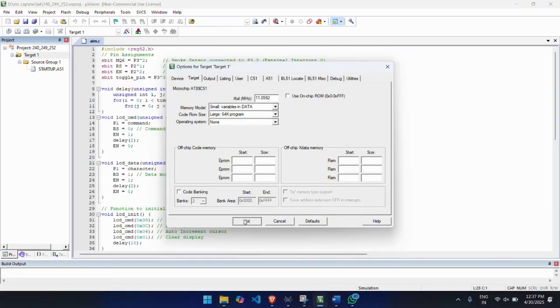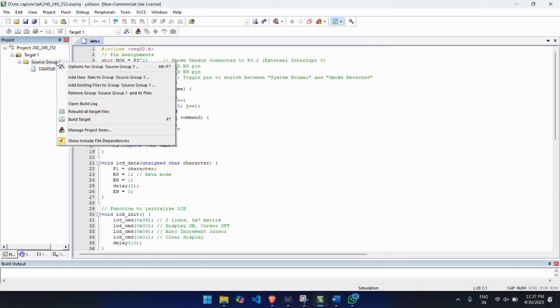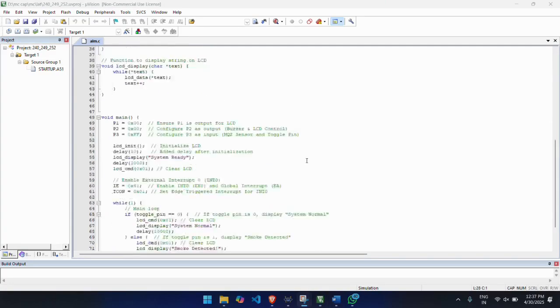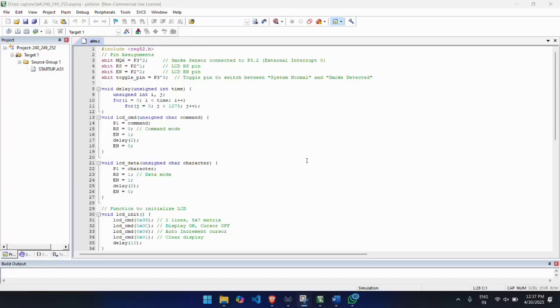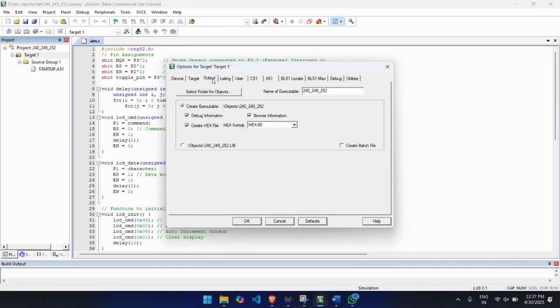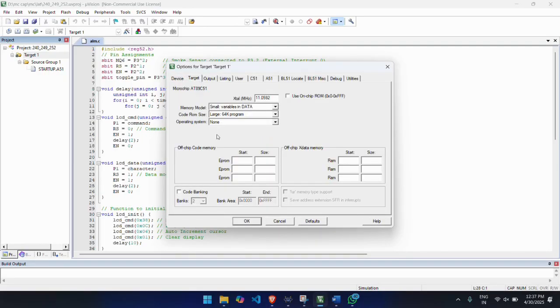5-volt DC power supply. The whole circuit operates on a regulated 5-volt DC supply. This is important because both the sensor and microcontroller require a stable power source for accurate operation. A 5-volt battery pack or a voltage regulator circuit like a 7805 can be used to maintain consistent voltage levels.